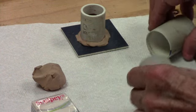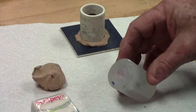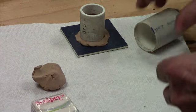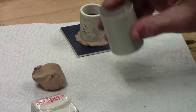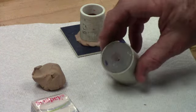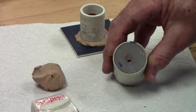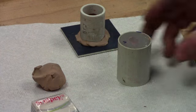and the reason for the taper is after you've injected or shot your wax into the mold, when you open the mold up and remove your wax model, you put it back in for another run, this taper goes down and you give it a slight tap, and it locks it in, and it makes a real tight fit with the two halves of the mold. So when the wax is injected through the sprue opening from the wax injector, it helps reduce any tendency for the mold to separate and open up, which will cause flashing.